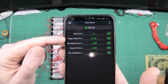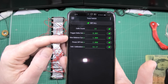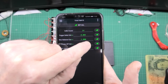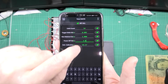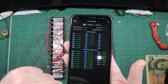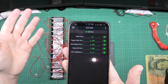The minimum trigger delta voltage it goes down to is five millivolts - it won't go any lower than that, which is a bit annoying. The maximum cell current you can set is one amp - these are only a one amp unit. The power cutoff voltage is the minimum voltage of the battery before it stops balancing, so I'll set that to 2.8 volts. For voltage calibration you measure the voltage of the battery. When you go in there it automatically populates, and you can adjust the total battery voltage but not the individual cell voltage - I don't know why.